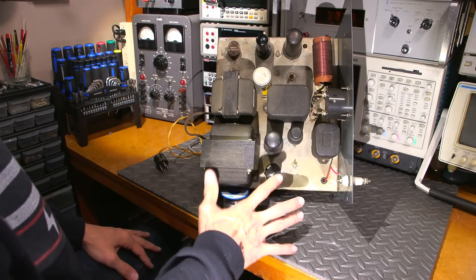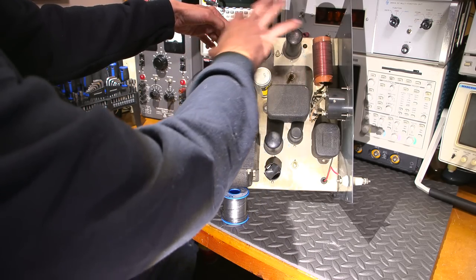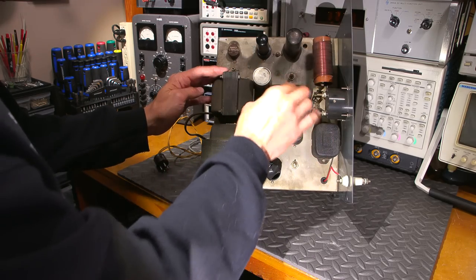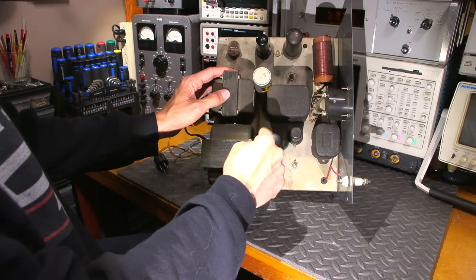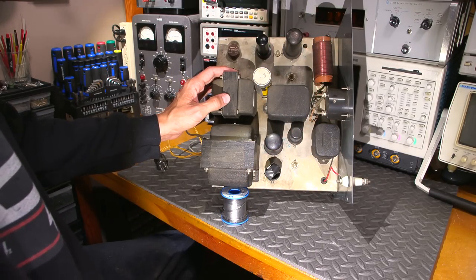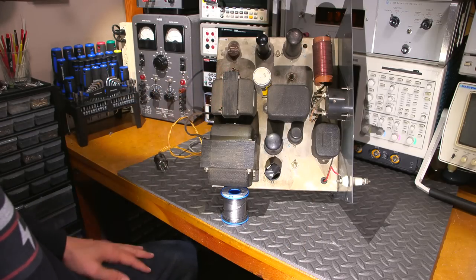On the top side of the chassis, you can see the crystal line indicates the RF section on one side and the audio/modulator section on the other. They've used the transformers as shielding between the two sections since they're clamped to the chassis. Metal-type tubes are used where pin 1, when grounded, connects the tube's outer shield to the chassis, giving nice shielding on the upper side. Good component placement overall.